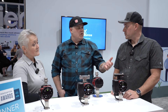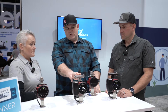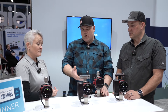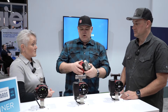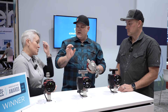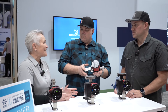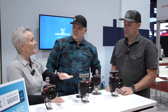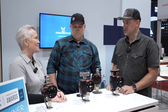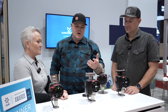A lot of people watching might see the flange connections from heating pumps in our videos — very common on heating systems. You offer it flanged for multi-family or even commercial applications. But for most residential work, these are union connections — capped off for display purposes, but you can have pretty much any type of piping connection or even valves, MPT swivel on the bottom. The best way to do hot water recirculation is with a dedicated return line. This pump is available in even its smaller twin sister — the 1529 is available in a union connection. We have the 1555 and the slightly smaller 1529, basically the same pump with a little bit smaller performance and a little bit less expensive.